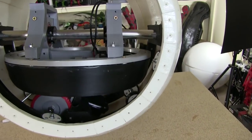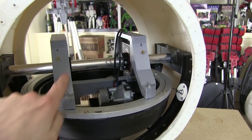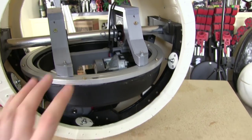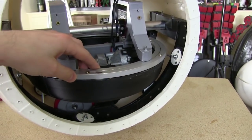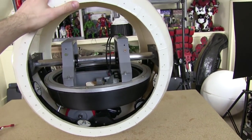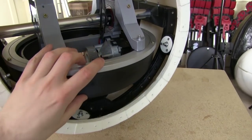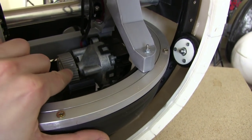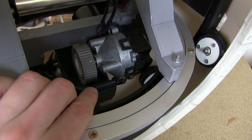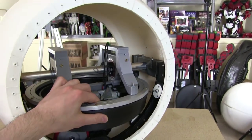Now for side-to-side stability, which is what was missing from version 2, I've got the trousers, because they're like a pair of trousers hanging on the washing line, and those suspend a large amount of mass in the form of this flywheel, which can spin round to make the droid turn on the spot. And that flywheel and all the mass also shifts. That has another motor which moves with the flywheel on a toothed track, and that makes the droid shift side to side for steering and stability.